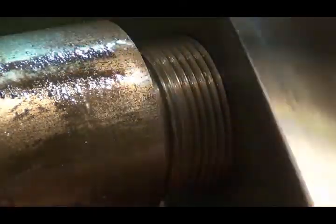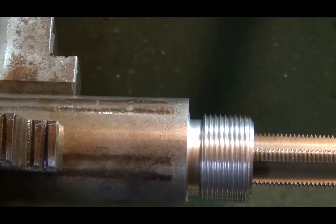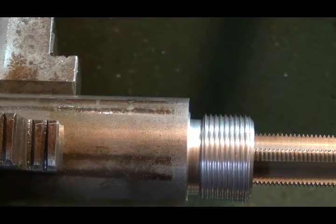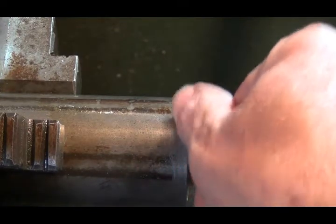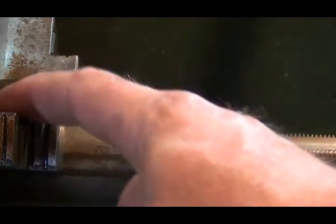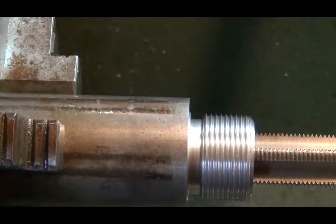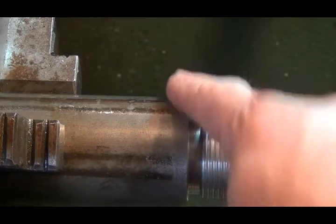So now the next step is to drill and tap the inside of this future nut. As you can see, those threads on the outside — inch and a half 12 — came out pretty good. I've got it drilled to 13/16 so I can tap the inside 7/8-14. Then I'm going to cut it off here, probably about a half inch in here. And then I'll put it back on the mandrel, put the mandrel in here and do my best to shape the top side the way I want and get it trued up, then put it on my mill and mill the flats.